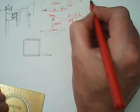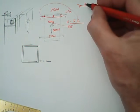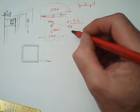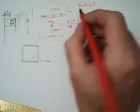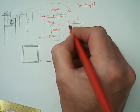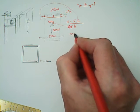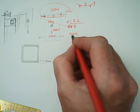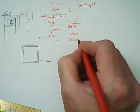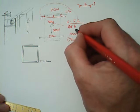It's divided by, now this number 48 is effectively what we would call an unpinned or free beam. And what they're talking about there is if you've got a beam bending and it's simply supported, this can go down, as the beam bends down, these ends are free to move upwards. Now if we treat it like this, we can use this very simple formula. And to some extent, this is going to be loose enough to allow that to happen. So we're good using this one.